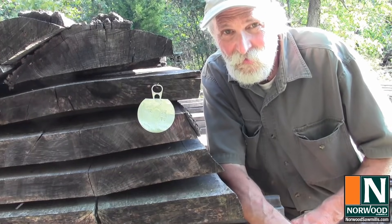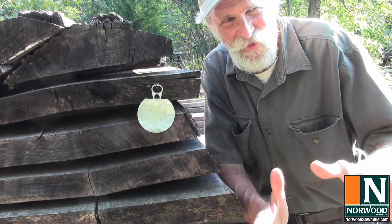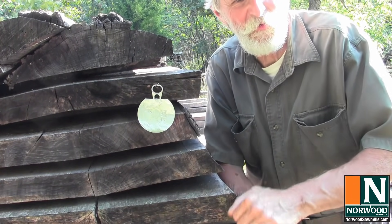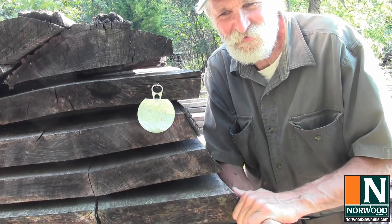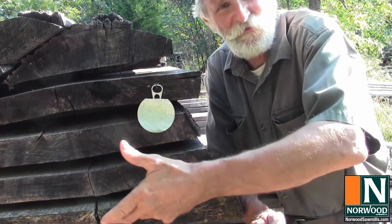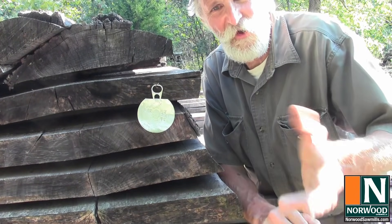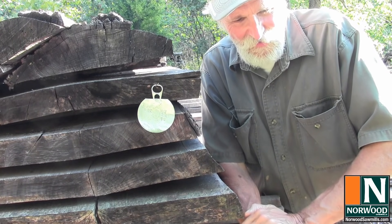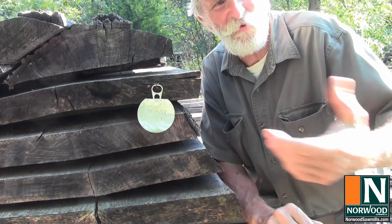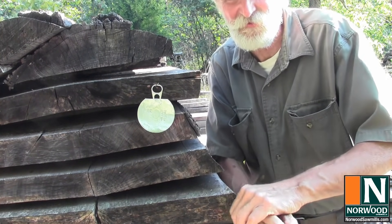So how do you know? You don't know unless you have a moisture meter. One thing you're going to run into is that after a period of time, when the wood weathers and turns gray, you can't tell one species from another. It's easy to think you'll just remember — 'I put the sweet gum in this pile, the poplar over here' — but I've got piles where I'll have to run boards through the planer just to figure out what they are.